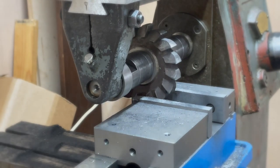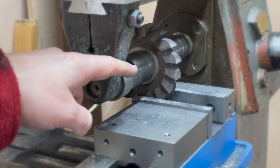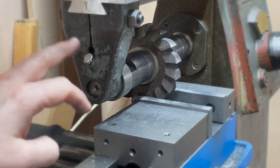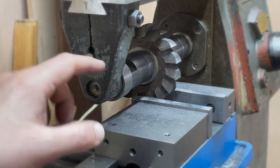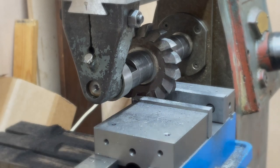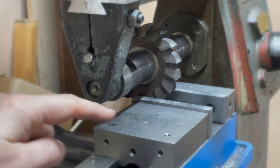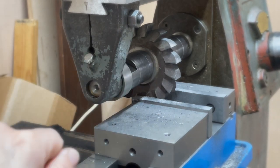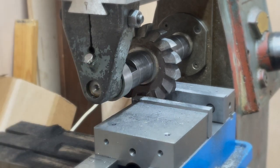The last time you saw me doing any machining in here I was setting up the Centec in the horizontal mode to mill some axle boxes. So here's the horizontal milling setup. I'm using a four inch diameter cutter that's five eighths of an inch wide. I've got quite a few cutters but this is the only one that leaves a very smooth surface — the others score the work, which I'm guessing is burrs or dings on the teeth, and as you dial the hand wheels you can see that line moving around like an Etch-a-Sketch.